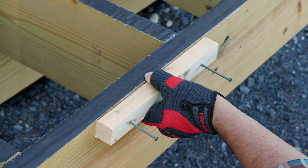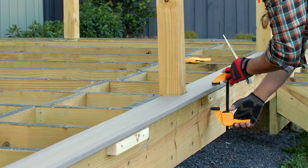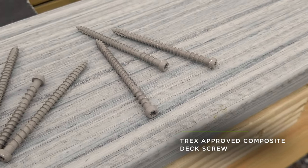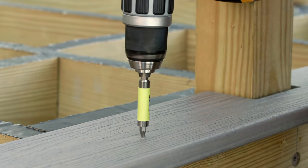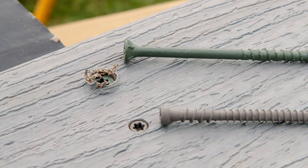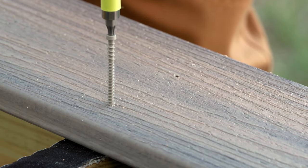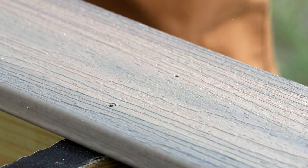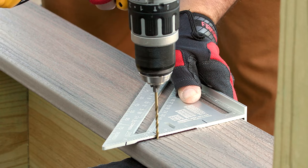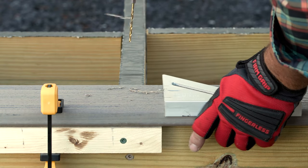After I attach some more inch and a quarter blocks to the outside of the rim joist, I flushed the edge and ends of my first boards to the blocks and clamped it in place. It's important to use an approved composite deck screw when fastening Trex decking through the surface or face of the board, which is what's necessary to fasten your picture frame board. These screws have a double set of threads that promote a clean and finished look. A standard wood deck fastener will create an undesirable result, so be sure to use the right fastener. Fasten the picture frame board with two screws at each joist, one at least an inch from the inside and the other on the outside, making sure you're always into the rim joist below. To avoid splitting, I like to pre-drill using an eighth inch wood drill bit just through the deck board itself, but not into the frame.